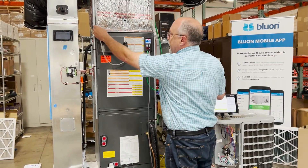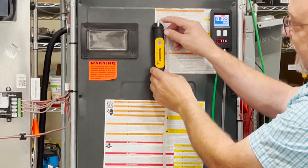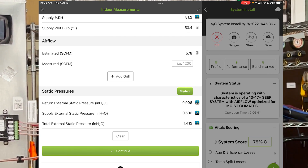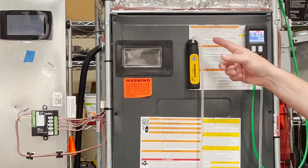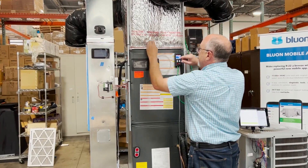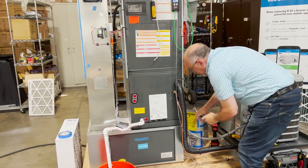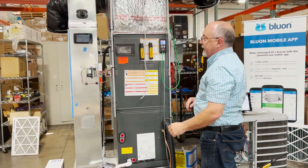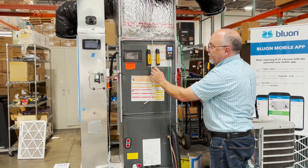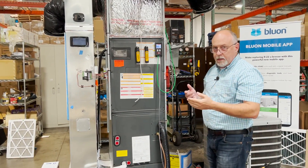I've got this pulled out, and if you were to take this tubing and drop it down — the weight on here kinks it off — it's going to create a pressure on the manometer. You can see that went from 0.98 to 0.90, so it's already registering a false pressure. The two choices you have are: make sure there's no strain on your tubing, or if you're going to leave it in ductwork, just pull the tubing off completely and let those stabilize. Now that they're stable, I'm going to tap on the button — it's going to flash blue — and that's zeroing the manometer.